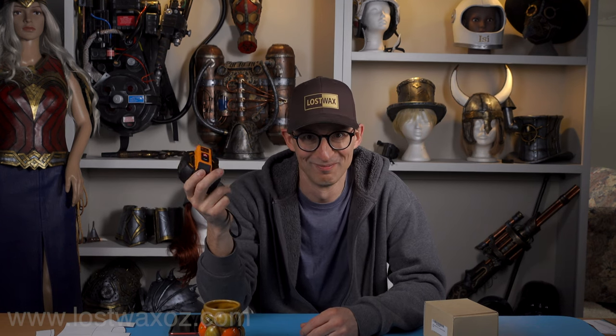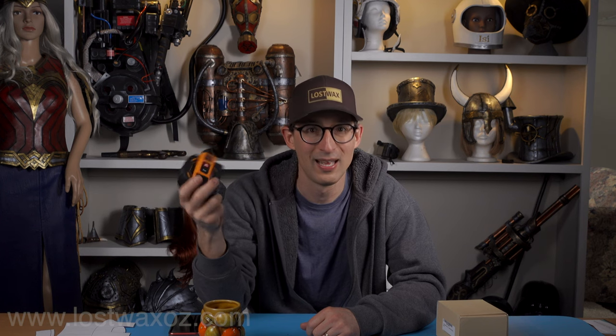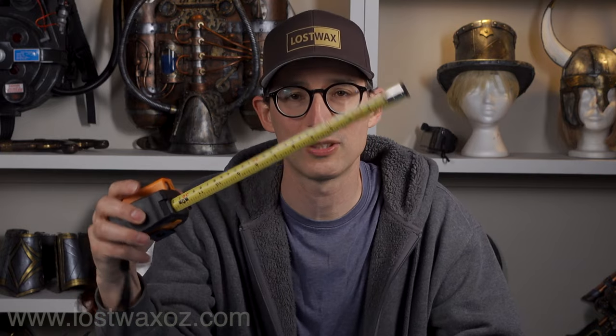So this is the end of the review. Is the laser tape good? Yeah. It'll definitely have its place in my tape measure pile. The tape measure itself is solid, and it's kind of nice because it has the markings on the bottom. The laser works well, though I wasn't able to get the 60 meters of range it claims — I was generally hitting about 30 meters. One thing I'd like to see is a cover for the laser lens, since if it gets scratched it might not work properly and I'm just throwing this in my tool box. Other than that, yeah — fun. Measuring. Who knew?